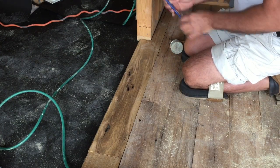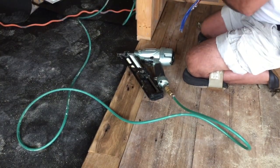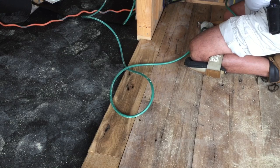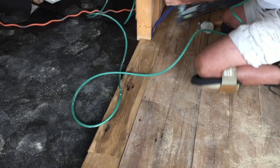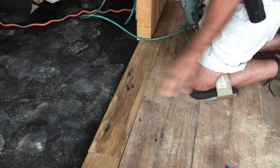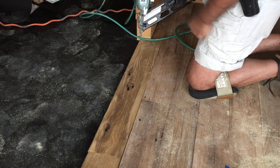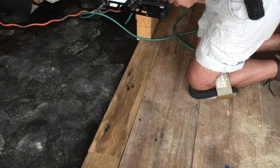You want to have a pry bar handy and your face nailer so you can pry this piece into place to get a nice tight joint, and then nail it along that edge. Now for this part which is wide open, we could use the face nailer, but the face nailer is not as durable — it doesn't hold the wood down as hard as the stapler — so we're quickly going to switch to the stapler and put in a few right here as well.